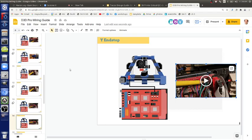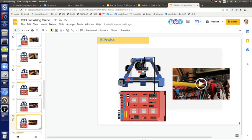So this is the Y end stop. Z end stop is the height probe, which is an end stop too. It's just an inductive sensor. The other one is triggered by a physical trigger; this one triggers by induction. It turns on when it senses metal, meaning it's close to the bed. It senses between 4 and 8 millimeters, triggering as far as 8 millimeters away. So that's the Z.